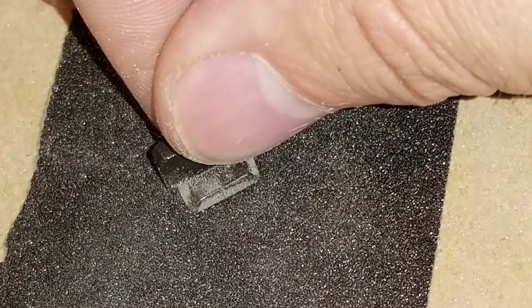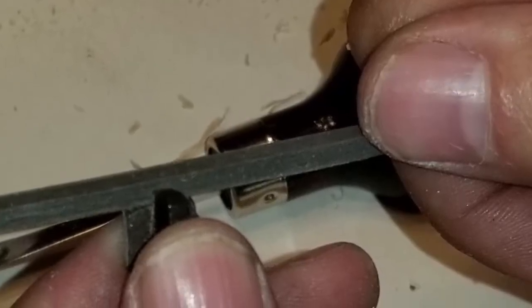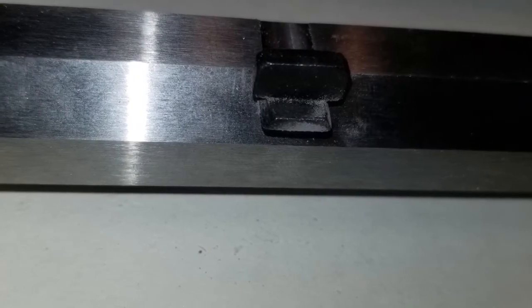I then started them and drove them in using a hammer, wood dowel, and small wooden block. I then marked the center reference points vertically on both sides of the barrel and fitted them in the stock and marked the stock lines on the barrel.